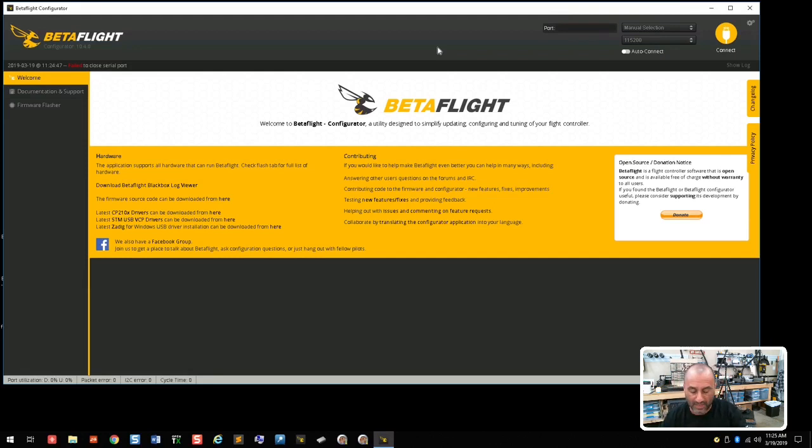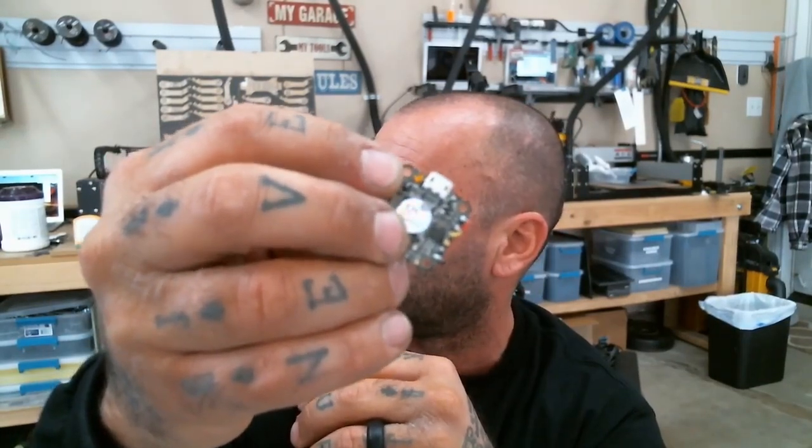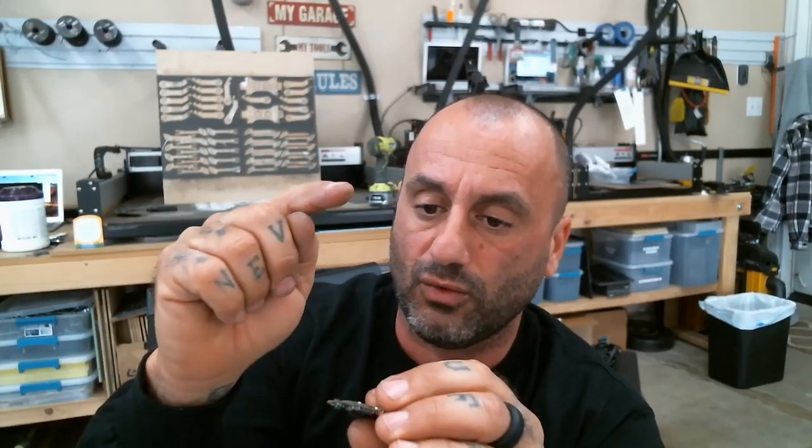Okay, so when you brick it, basically what happens is at this point you've got this. Let me make this screen a little bit bigger. This is an RM8 one, so you're going to see soldering on here, but you'll see that little gold button right beside the USB port. When you need to unbrick it, you're going to press that button.